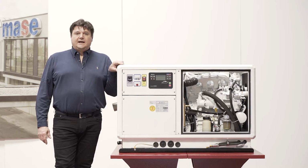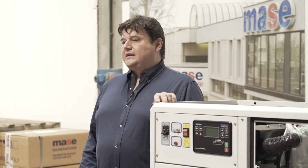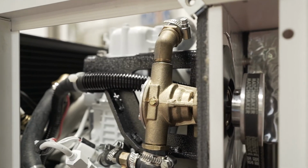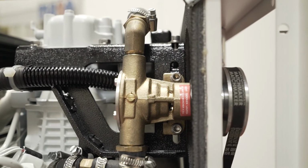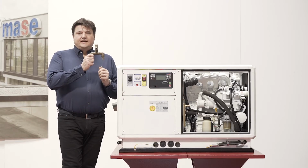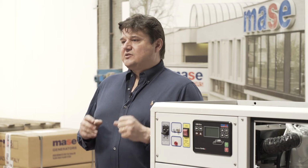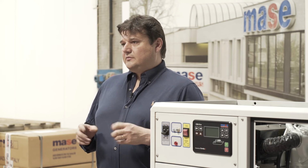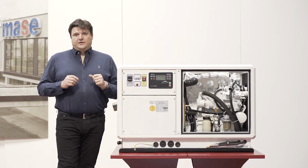I recommend installing a decanter diesel fuel filter upstream of the unit, so as to always guarantee water and impurities-free fuel. I suggest the use of the anti-siphon valve, which is intended to save the group when it is installed below the waterline and also in the case of fast-planing boats. In fact, in the latter, the pressure that develops in the hull pushes the water into the sea intake, drowning the group. The anti-siphon therefore counteracts the pressure and prevents drowning.